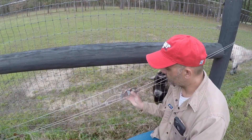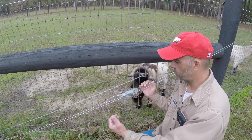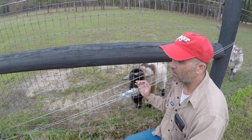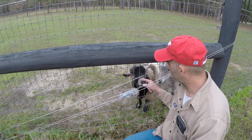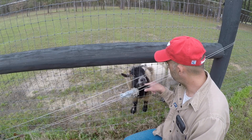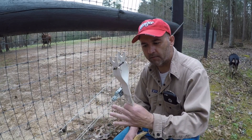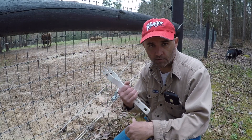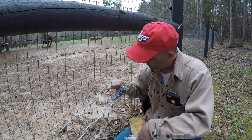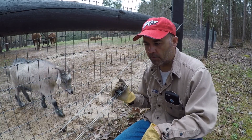What we're going to do now is I've got these tensioners on the corner post to keep them tight, which helps keep the fence tight. I have a tool that you use to ratchet them to tighten each one up. Each corner has two tensioners, so I need to get all those checked to make sure they are tight. To tighten these strainers up, all you need is a ratchet strainer — I got this at Tractor Supply. You don't have to use one of these, you can use a regular socket to tighten them up.